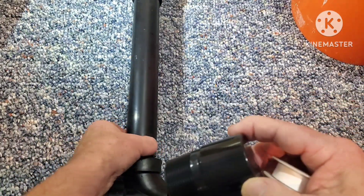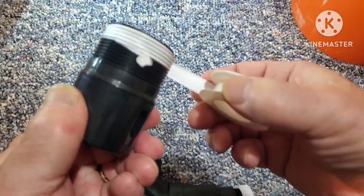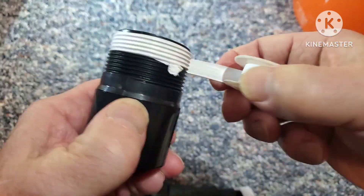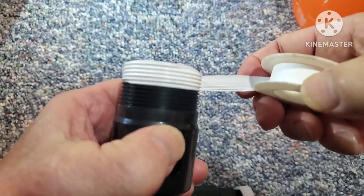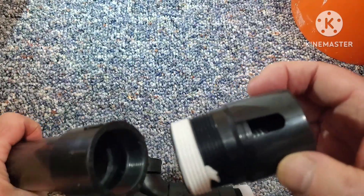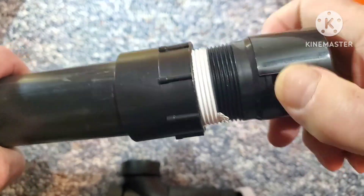That's going to vent this drain. Probably a good three to four wraps, nice and tight with some Teflon tape, and then screw it in there real tight. I'm just mocking this thing up so you can see what I'm going to do up inside this sink because I know somebody is going to say, 'Oh, you don't have a vent.' So this inline vent is going to be up inside under the sink after the fact. I can't do that until the sink's here, so right now I've got everything capped off.